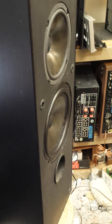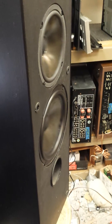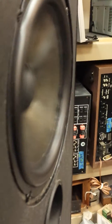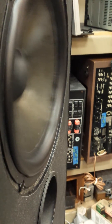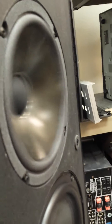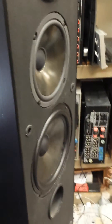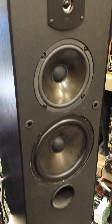You can see right now at moderate power it's normal. You start to hear a little bit of distortion there towards the limit. Look at that — see how the cone ripples out there? The top one too. Top and bottom. So that's an example of why you want a really high strength but lightweight cone.